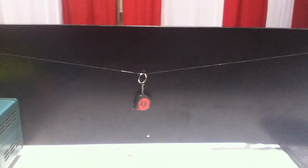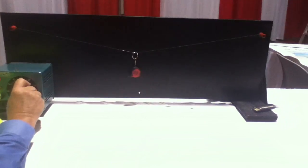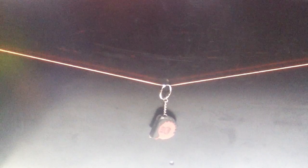I'm going to heat it up, and you'll see the wire start to go down slowly. We'll get to a point where we're putting enough current that it glows red, and that's getting close to where the phase change will be. It's starting to glow red there, and we see it stop, and then slump down further as it gets hotter. Now, if I turn it off — see that little jog in the wire? That was it cooling down enough to go through the phase change, and instead of just cooling and getting shorter, we had a phase change — that was that change in the speed of cooling.